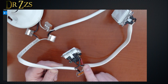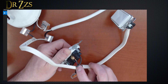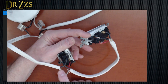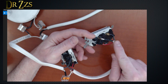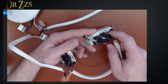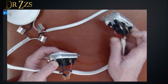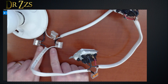So this black wire is going to the common pole on the first three-way switch. The white from here connects to the white from a bundle of three that will be traveling to the next three-way switch. The other two wires in this bundle — the black and the red — go to the non-common poles on this switch. Red goes to one pole, black goes to the other. And again, this black wire goes to the common pole. Now when we go to the second switch, this white wire that was the continuation of the power into the box is coming into this switch box and going to the common pole over here. We need to insert our smart device in here.